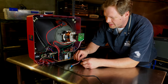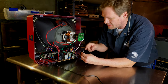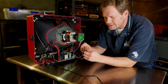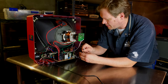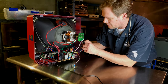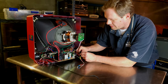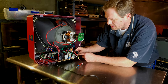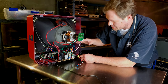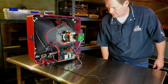I just wanted to test this and make sure it was still going. Here's one last look at the inside before we put the back shell on. This is our audio out, wired so that stereo audio can be drawn from this point and put to any speaker, headphones, or anything really. And of course this is our SCART adapter that will be mounted as an input. That's pretty much it - let's get that back shell and slip it right into place.